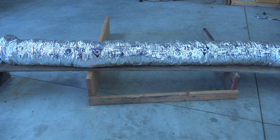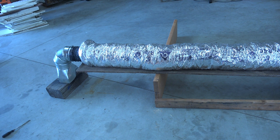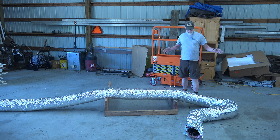If you can put a piece of plywood between two pieces that are four feet apart — those two-by-twelves — and lay the duct on a piece of wood, even a two-by-four, it's going to be better than hanging it. I can make it straight, pull it out, stretch it. If I have my boot right there, I can stretch that out and it'll be a straight run that moves plenty of air.